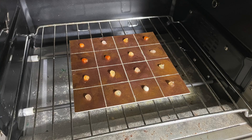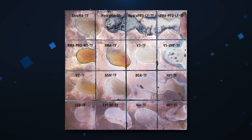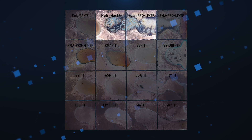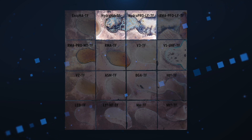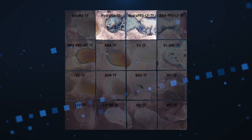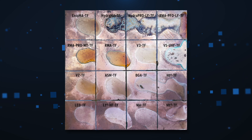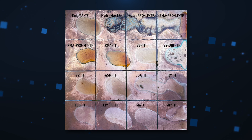To begin with, I want to test how they react to heat, so I've baked the blobs of flux in a hot oven for a few minutes. These fluxes are water-based, so you can see how runny they became when heated, and there are some green flecks where the flux has reacted with the copper underneath. Some of the fluxes stayed in neat little blobs, while others got quite runny and strayed out of their squares.